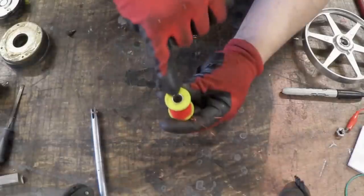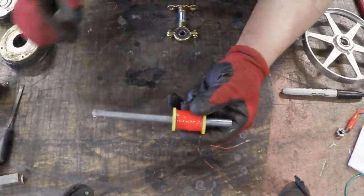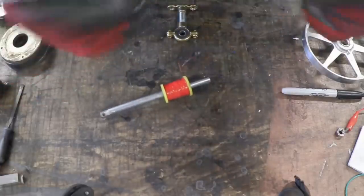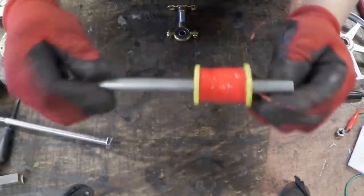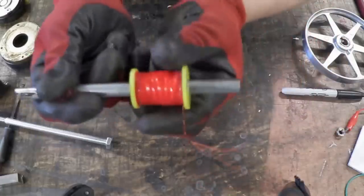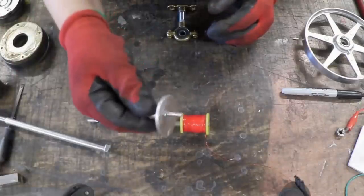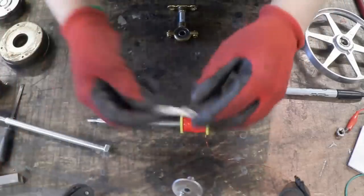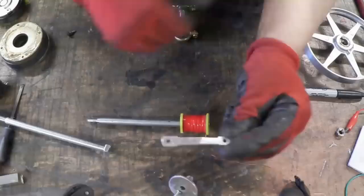You can use those ideas to make a switching flux generator, or a simplified version of it. So there's a coil — it holds a bit of pipe, and it was exactly 10 millimeters. So I've got a 10-millimeter bolt. I've cut the head off that bolt, cut it to size, and then cut a slot in it. We've got a little driving slot right there, drilled it, cut the end off, and that slides nicely in and out of the center of that coil. We need some kind of crank, which is made out of a bit of aluminum disc and a bolt, and another little connecting rod — just two holes in a strip of aluminum.